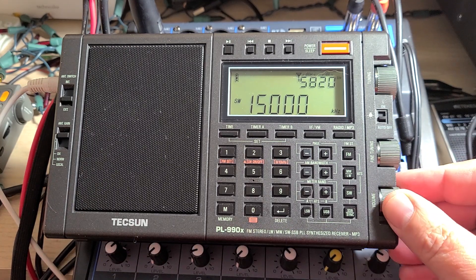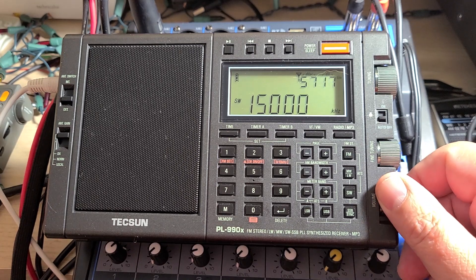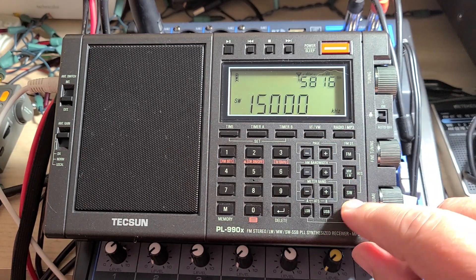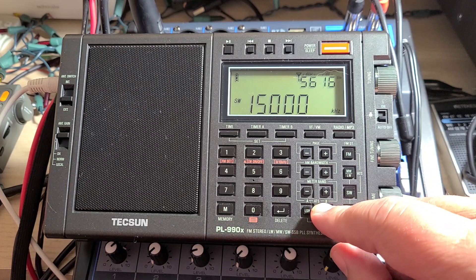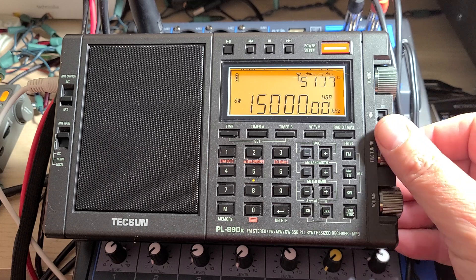The radio isn't perfect, so between upper and lower sideband there's a slight few hertz of difference, but your calibration will be as close as it can be for this radio. Once you've tuned, you go into upper and lower sideband to compare and try to zero beat with the fine-tuning button.